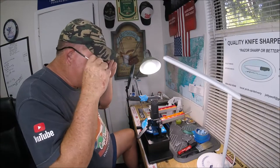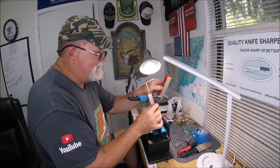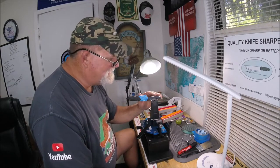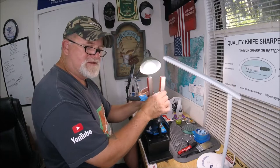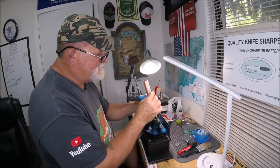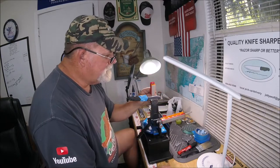So I'm at 200 right now, and you can feel that the 200 has smoothed it out. Once you get there you can feel the stones not biting as hard, but the thing is sharp right now and it's only 200 grit. One thing you have to watch: it's easy to just swipe out here on the middle or end of the blade, but you want to make sure you get up here by the handle, because you want it equally sharp on the entire blade.